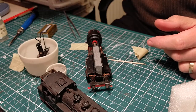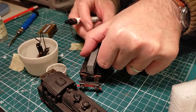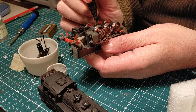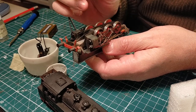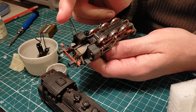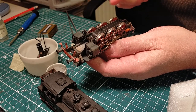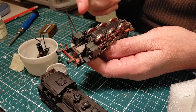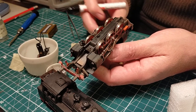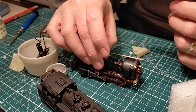And this is a very good marker pen. This writes on glass. Let's see if it's okay. Perfect. We just take a marker pen, and we just do a very simple thing. We draw a wee arrow. If it's wanting to write, come on, you're wanting to write. And we draw a wee arrow like that. That's forward. So we know that when we fit the base plate back in, it goes forward, the arrow, and that's the original position. Not to make a mistake and then put it in the other way around, and then maybe it doesn't want to go in, it doesn't want to tighten, etc. That's the last thing you want to do. You don't want to make a mess just because you didn't do a marking, no?